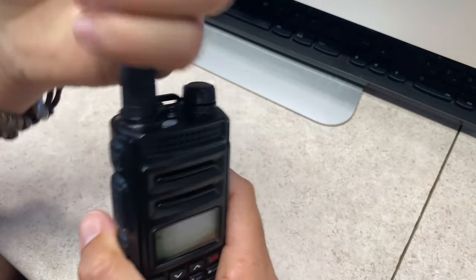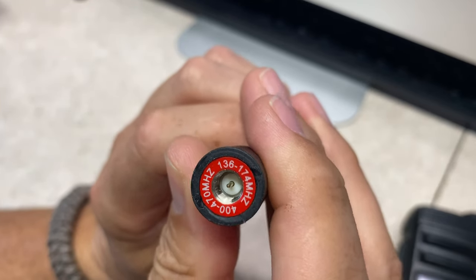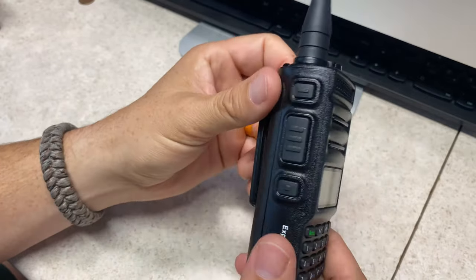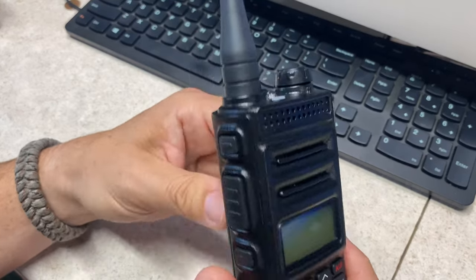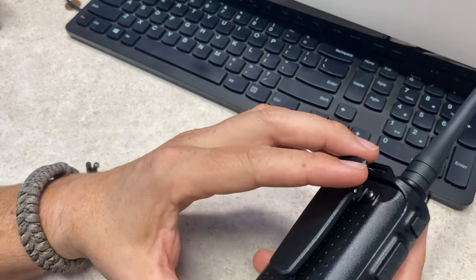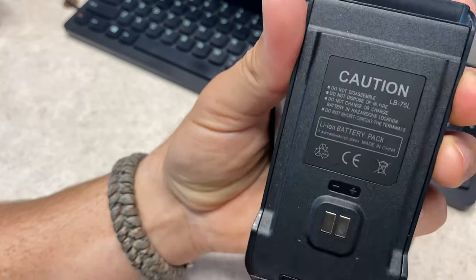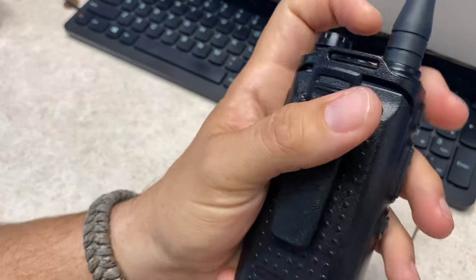Over 100 miles and I'm getting him and he's getting me on a rubber ducky — that's very impressive. The rubber ducky itself is labeled for 2 meters and 70 centimeters. The antenna is SMA male, so the radio is SMA female, as you'd expect. So if you're going to buy an aftermarket antenna for it, there you go. Overall, impressive little unit. I would definitely buy this if I were in the market for a radio. At Gigaparts, at least as of when I'm recording this, it's $59.95 for the radio as it comes in the box. They under-promise and over-deliver on the battery — the spec sheet calls for 1,300 milliamp hours but the battery is marked at 1,400 milliamp hours.